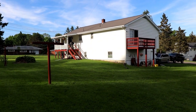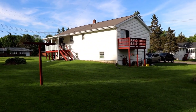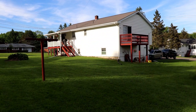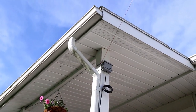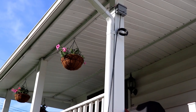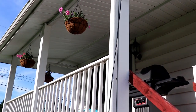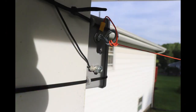What you're seeing here is the antenna setup that I have at my father-in-law's house. As I said, it's kind of temporary. This is an end-fed wire, very similar to the one that I reviewed, the EF53 at my house in Kansas. The key difference here is that the wire on this one is about 140 feet long going up into the pine trees, and the 9-to-1 un-un on this one is homemade. I got myself a toroid and some wire, found the plans on the internet, and made an un-un for myself.